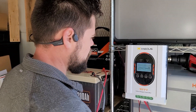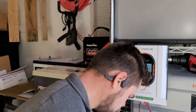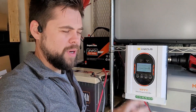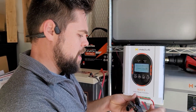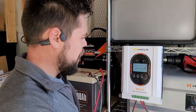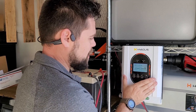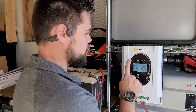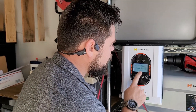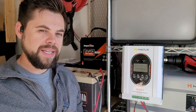I got this charged up and we're all good to go. I can see my current battery voltage is 13.19. I've got a single 200 watt solar panel — we're not in solar peak hours so I'm not expecting a lot of charge — but I connect it up and the panel is already putting out 19.6 volts. It clicked on and we're starting to get current, which means volts times amps equals watts. Right now we're already at 88 watts, going up to 110.